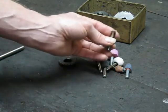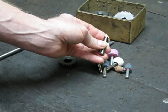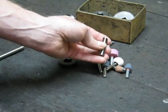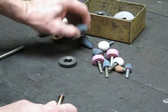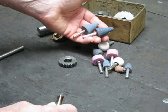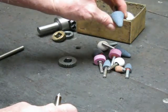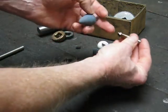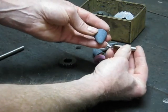The tricky bit is how do you get that profile right? When you first start cutting gears, you're going to have a lot of hassles trying to get the right double-sided profile — you get one side right and then the other side will be wrong. You really need to do it precisely and accurately. The way I do it is a simple way: you will have to buy yourself a little set of grindstones. These are those cheap grindstones you get in a kit — you can get ten or a dozen for about ten bucks. The ones you want are the tapered ones, and we're going to use the taper of the grindstone to actually grind the facets on the high speed steel blank and put some back relief on it.